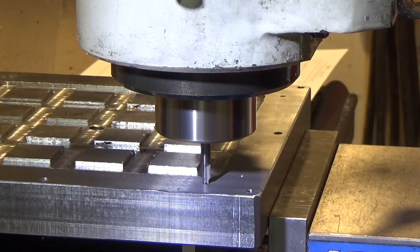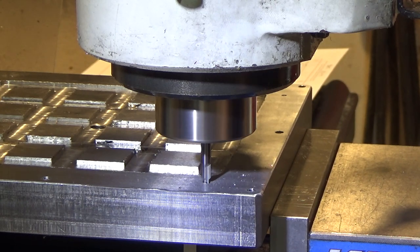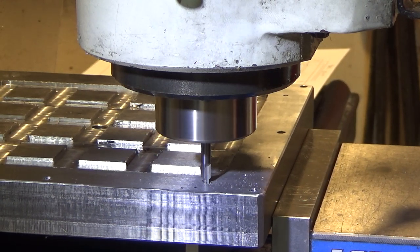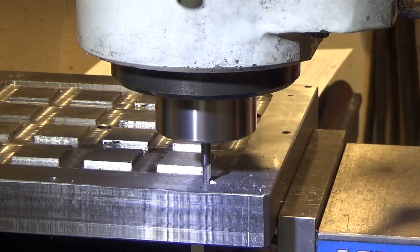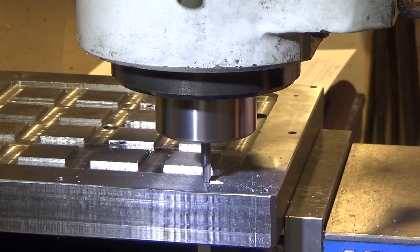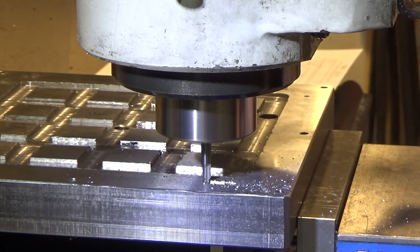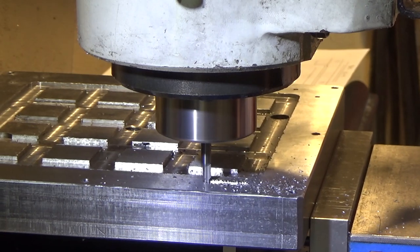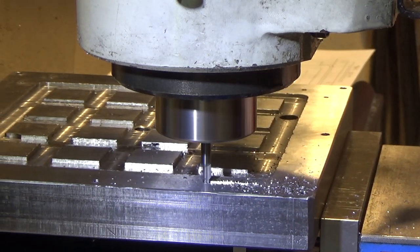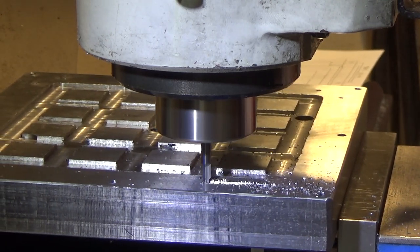Since I had so much trouble with the other grooves with end mills, I decided to only do a 50 thousandths depth of cut on this first pass, and what that ends up doing is leaving a really terrible burr. Fortunately when I do the second 50 thousandths pass — the total depth is 110 thousandths — the chamfer will clean up all that burr and also provide a zone of relief for the o-ring to expand into, which makes the contact patch a little bit bigger.